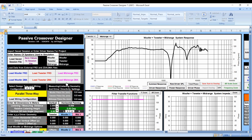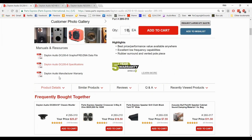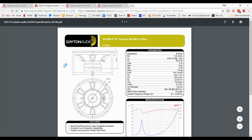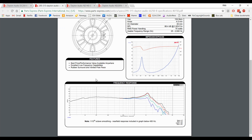We'll talk more about that in another video. You don't have to look for an 8-ohm or 4-ohm tweeter specifically. Now let's talk about where we want to cross over. With a woofer in a three-way system you're typically crossing over somewhere between 400 and 800 Hz — some people cross over a little higher, but most are in that range. We know from an earlier video that the breakup is at 2200 Hz, so we want to cross over before that — ideally by 1100 Hz. Looking at the off-axis response, below 500 Hz it's really good, so we'll target about 400 Hz.